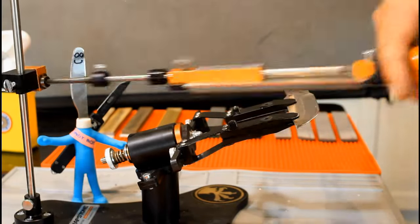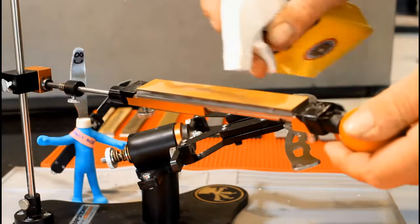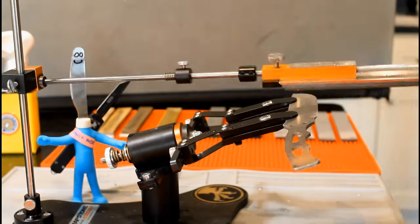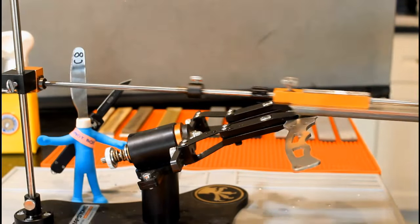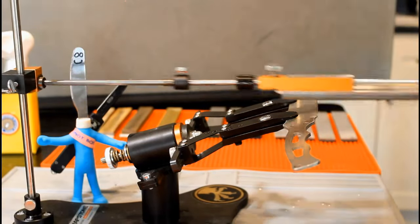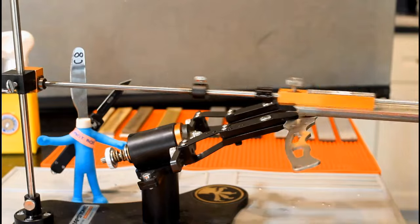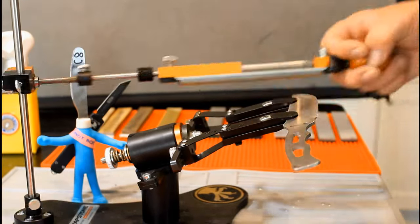Be advised, sharpening stones vary greatly. One brand's 600 grit is another's 1200. That's pretty bad. Add to that, you must deal with at least 4 separate scales of coarseness when shopping for stones: grit and microns, as previously mentioned. The Soviets have yet another scale, and Japan has their own unit of measurement.